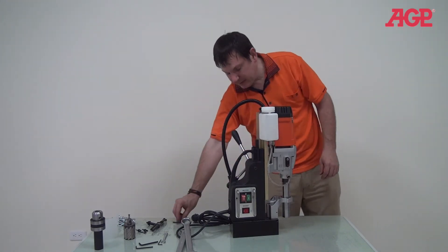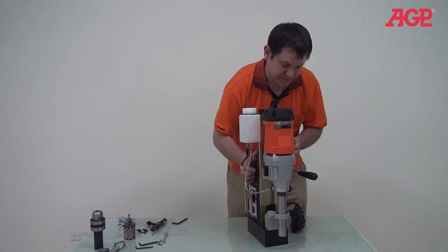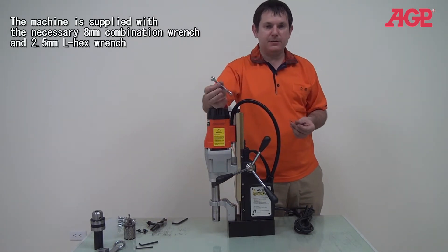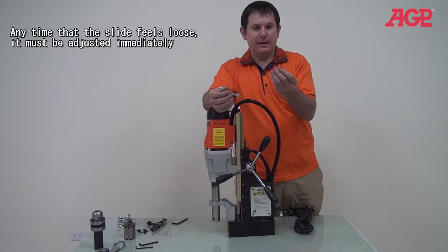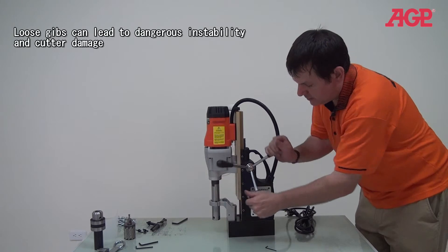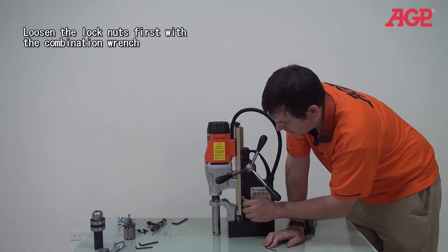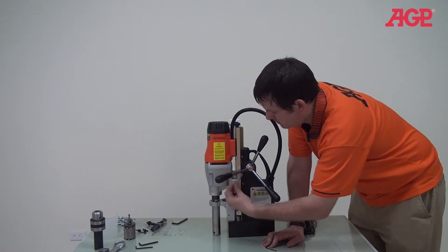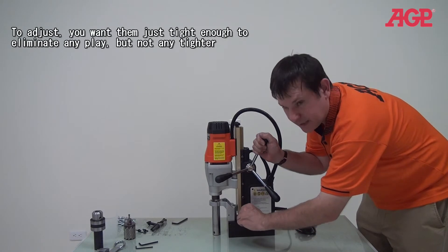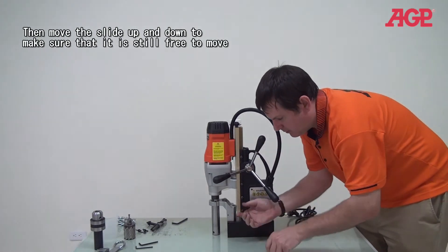Another important adjustment is to turn the machine around — that's when we adjust the gibs. When we adjust our gibs, we're supplied with an 8mm combination wrench and a 2.5mm hex wrench. You want to adjust each of these gibs while going through the range of motion. Make them just snug, not tight — just so it's not loose. Take up all the play and make sure we're good, then tighten it.